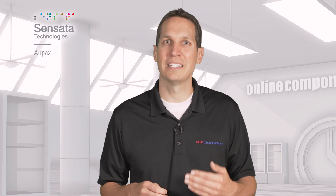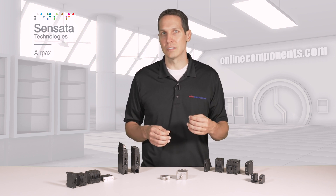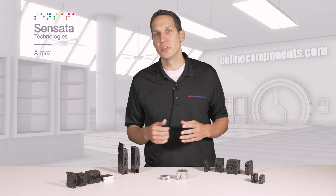With a magnetic hydraulic circuit breaker, the circuit breaker acts as a solenoid where the core is held in a fluid-filled tube. The fluid dampens the motion and the core is moved by a magnetic field generated by a coil. This movement of the core reduces the reluctance of the armature, causing the armature to be attracted, trip, and open the contacts.